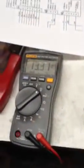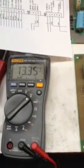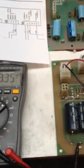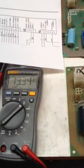Now keep in mind, as you can see on my meter it's 13.3. The reason it's 13.3 is because it is unregulated voltage coming in — it gets regulated on this board down. So 13, 14, or 15 volts is all acceptable and within range.